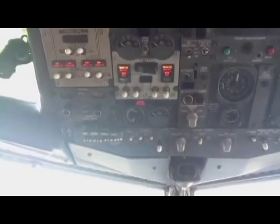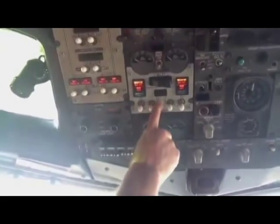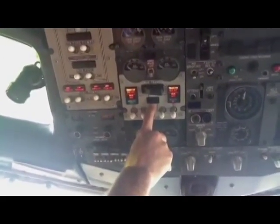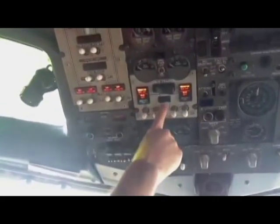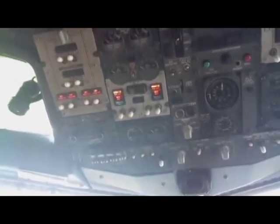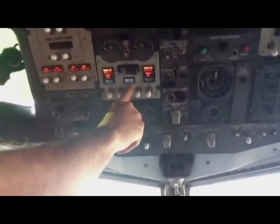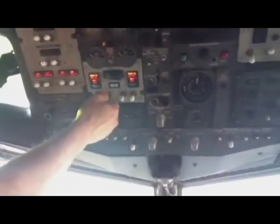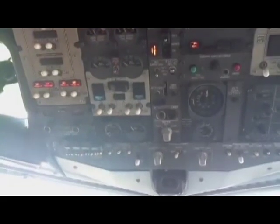Now we're watching — watching what gauge? Right now just listen, you'll hear it start firing up. This light will come on when it's ready. Sometimes it's very pale, you can barely tell. See how dim these two are right now. How about the exhaust gauge? We're down here — okay, we're good. Once that light comes on, pull these back down one at a time, and your APU's up and running.